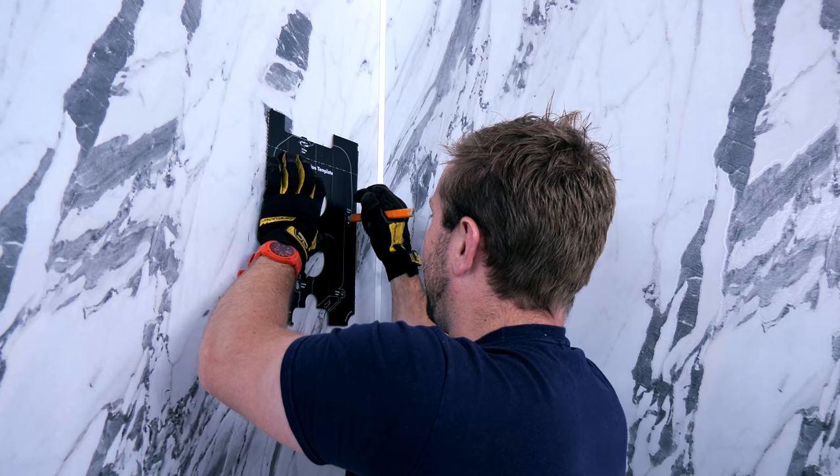You'll notice here that I'm using my impact driver to do up these screws. I'm very familiar with this tool, and I know how to use it. That being said, what I'm doing is actually screwing up nice and lightly, and then for the last bit I'm just using a hand screwdriver. Now that we've got this screwed on the wall, there are slots and a standard hole — make sure when you're tightening them up that you don't use an impact driver all the way. Just tighten up finally with a hand screwdriver, because we're going onto plastic shrouds here and they can sometimes split a little bit.